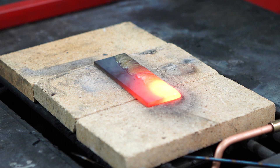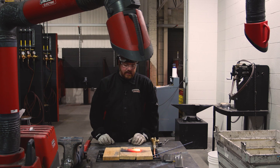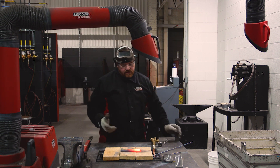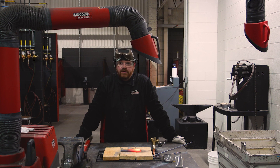If you look at that weld as it cools down, you notice the coloration — that's a desirable coloration. There's also no porosity on the surface of that weld, which means I had the correct gas mixture, proper heat, and proper travel speed. That's it — this is cobalt hard-facing of stainless steel. I'm Lance Bess with Lincoln Electric Weld School. Thanks for joining us in another master class.